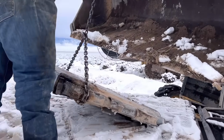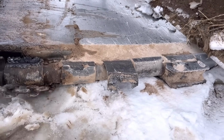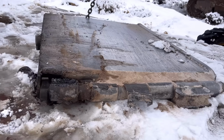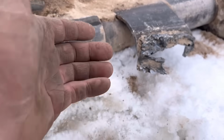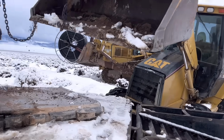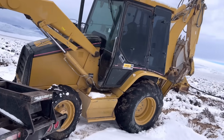What we've done twice now is like a piano hinge style deal where there's a huge pin down through a bunch of pieces of pipe. The first time we did it big, this time we did it even bigger, but it don't matter how big it is. The torque that ends up being on there rips out those pieces of pipe like it's nothing. So I've got a different idea to try. Take a whole day or a day and a half of work in the welding shop, but I'm gonna try a different design this time, I think. So, it's frustrating to get nowhere in life.